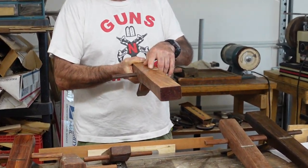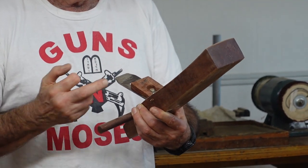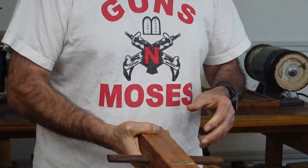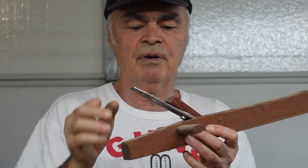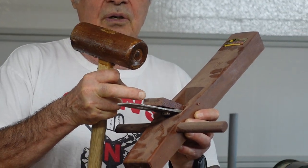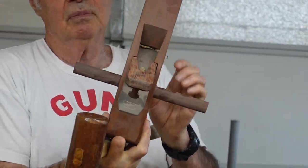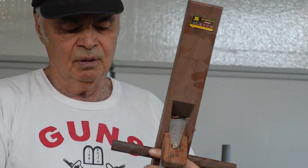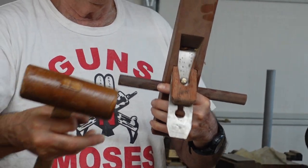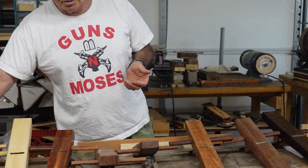Here's another Chinese plane with a little bigger opening. You can use that for either fine work or rough work. Most of these blades are generic, about 44 millimeters or an inch and three quarters, set at 45 degrees. They're very easy to adjust — you either tap the wedge forward to tighten the blade or hit the back area to loosen it, and put your thumb or forefinger on the bottom to catch the blade, otherwise your blade will go flying. Keep that in mind when using these Chinese planes — there is a learning curve. A lot of these blades I got from Woodwell in China or from eBay, where there are a number of sellers.